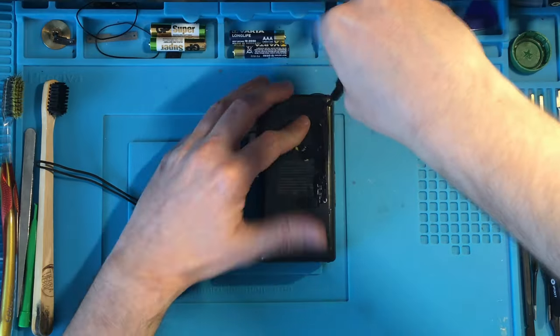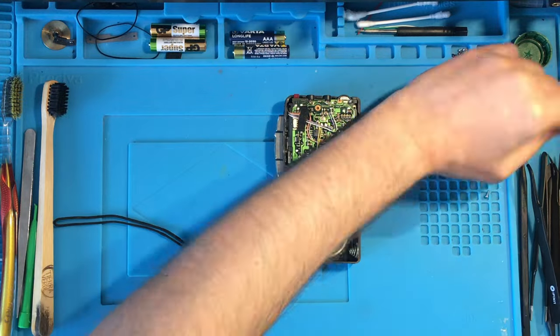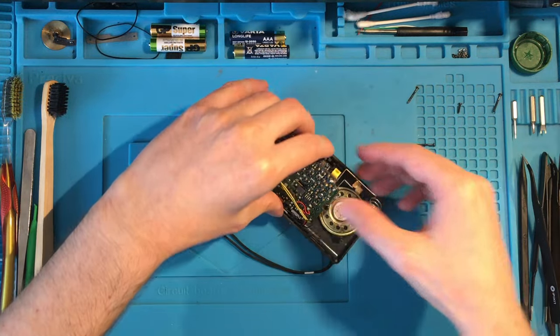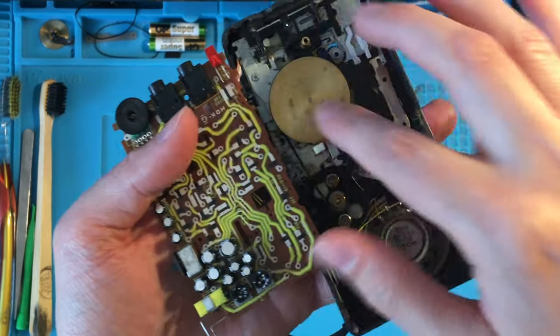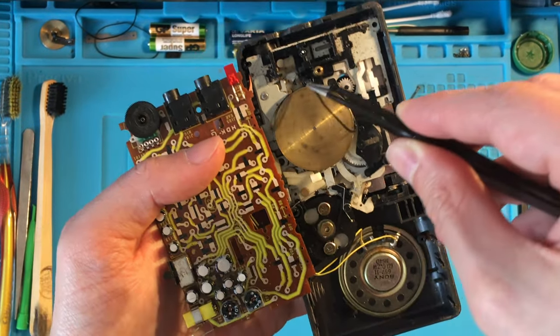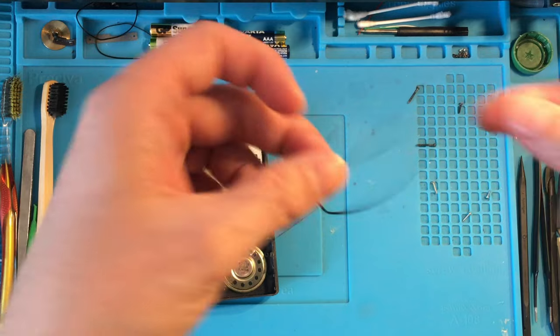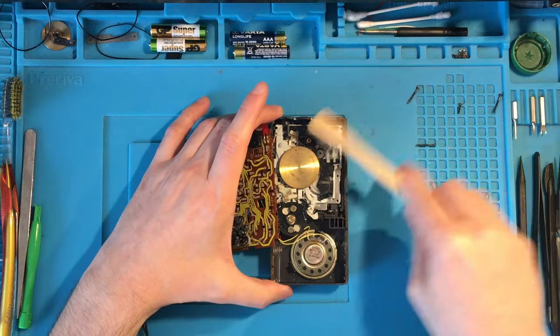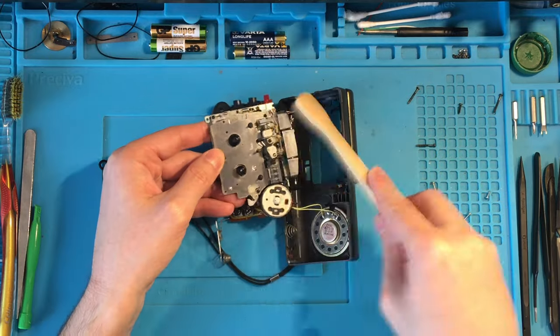With the third device, everything went smoothly and without issues. The belt was exactly in the same condition as in the previous device, loosened but not sticky at all, and easy to remove. I repeated the same cleaning operations with toothbrush first and air duster.